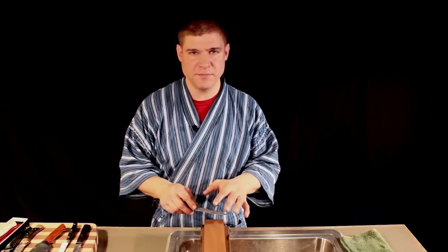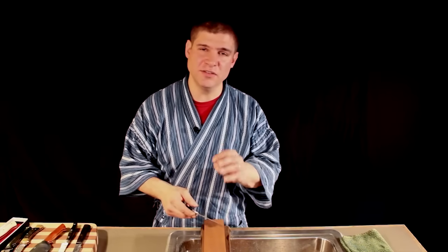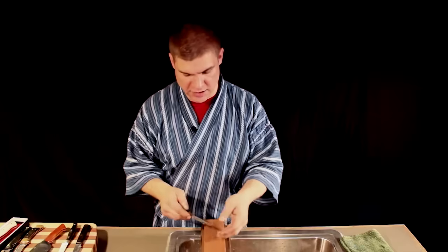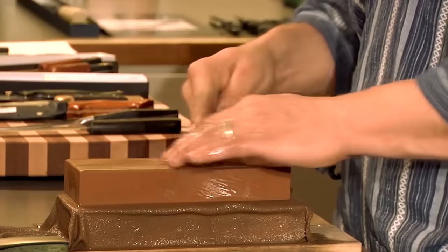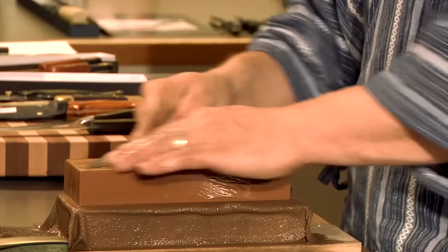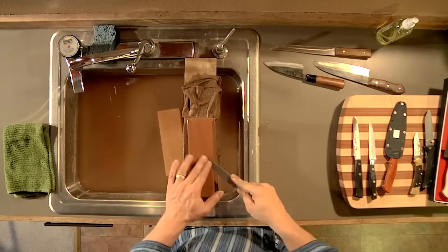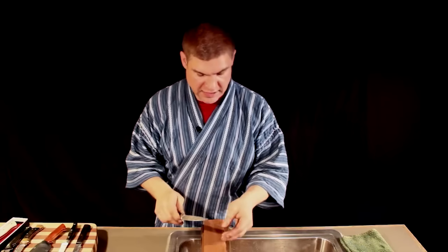Try to have the discipline to keep working at it. Some knives are in such bad condition and the steel is so hard in them that it'll take 30 or 40 minutes of just grinding that primary edge before you establish a new one. But the good news is you'll know when you're there, when your 3 fingers tell you that you have a grabby edge that's ready for cutting. A lot of guys, they go through these motions and they do everything right, nice and slow, and then they give up in frustration because the edge isn't sharp.